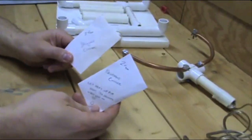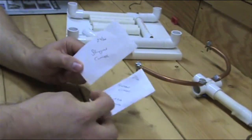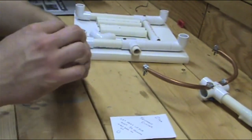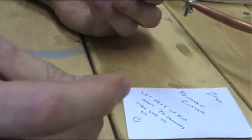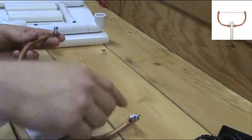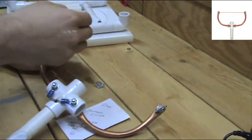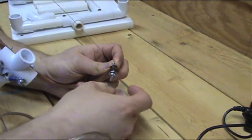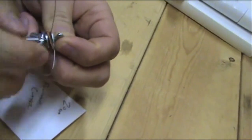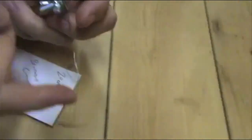You'll get two packages of wire labeled 20 gauge and 24 gauge. The 20 gauge is for the bendable cutter and the 24 gauge is for the straight wire cutter. One end has a ring terminal and the other end is folded over so no one pricks their finger. The ends have thumb screws and wing nuts so once the wire is attached it's firm and secure. I recommend putting the wire on the backside so it doesn't get pinched as you twist down the wing nut.